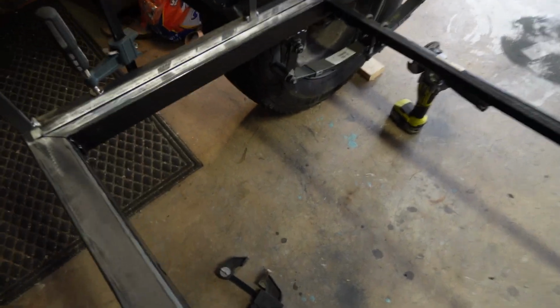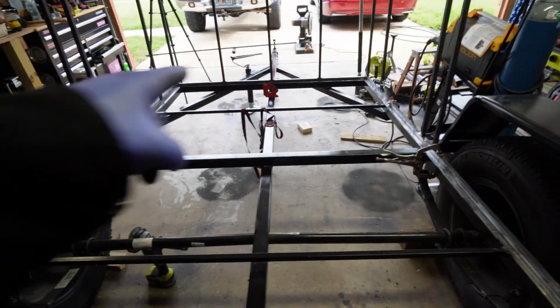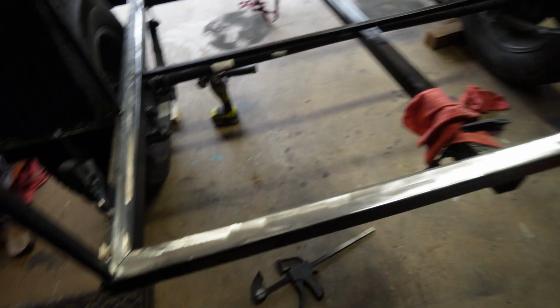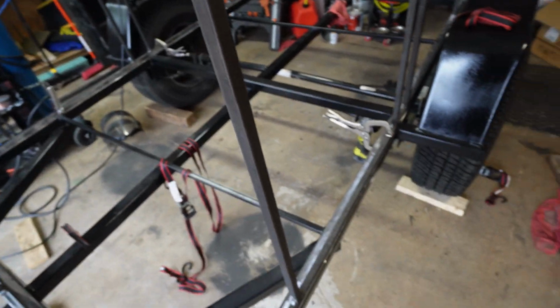Now we're gonna weld our walls to our trailer, and this is gonna be pretty simple. We're just gonna run some beads down this entire line. Not going to go the entire way because that's a ridiculous amount of weld, but maybe 5 or 6 inch or 2 long down the way along with the front, and then we'll get to the back and I'll show you my plans for the back. But we want to make sure that this is still perfect with our 1/4 inch. It looks down there that it's a little warped out, so we can tuck it in. But back here, this is about what we want right here, because we want to be able to set our wall panel on and then fold it up to make it easier on how we mount it. Then we have to clean all this metal and paint it.